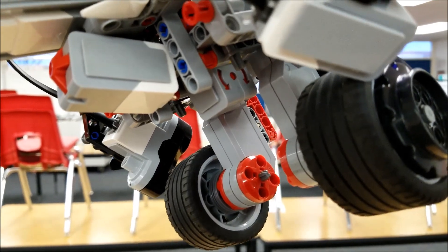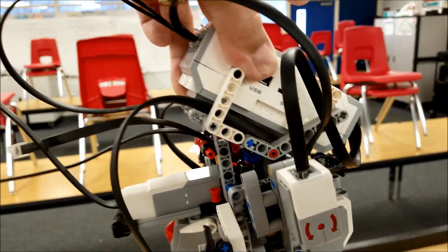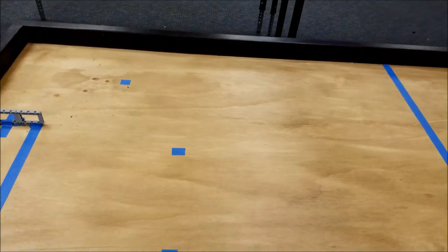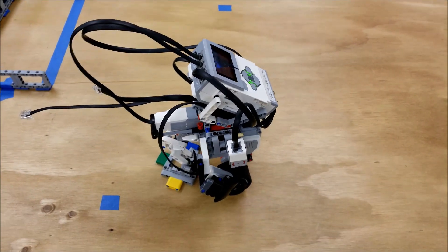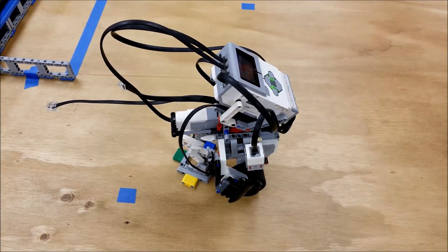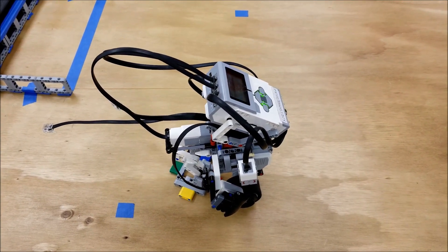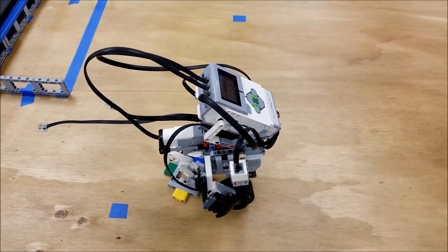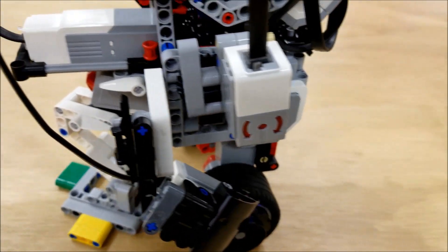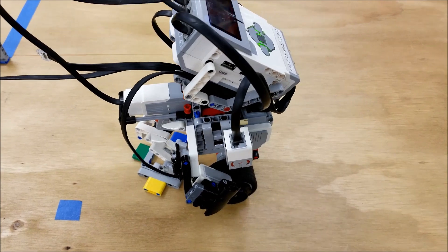You can see where the gyro sensor is placed facing down, and here it's facing forward, and you're able to see the curves of the gyro sensor. What was happening is the program was not running. We checked all the ports and we were getting an error message on port two, which is the gyro sensor. We all collectively went 'oh no' — that sensor is what makes the whole thing run. So we thought: why not just use another gyro sensor? Why can't we just bypass the other one and plug this one into port two where it's supposed to be?